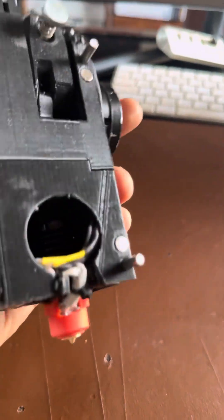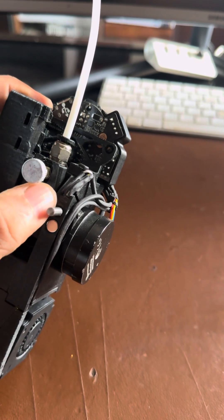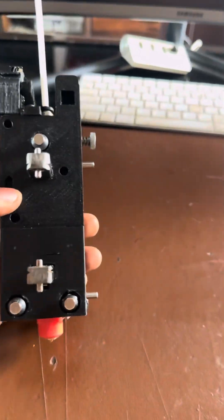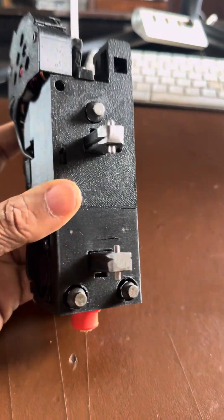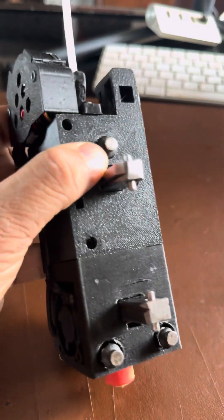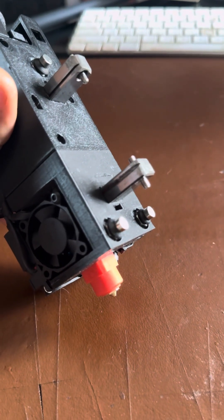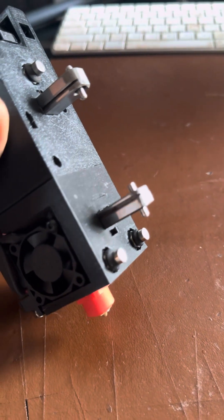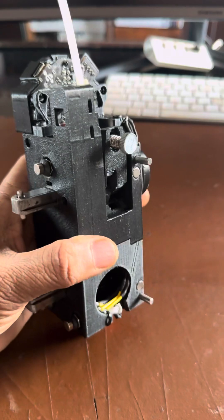There is a Hall effect sensor here to check for docking, and another Hall effect sensor on this side to check for the attachment to the carriage. These Maxwell coupling pins are essentially M5 button heads with a 6x3 magnet glued to the top, which constrains motion in the Maxwell coupling and provides repeatability, as seen from the test done a couple of days back.